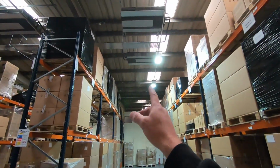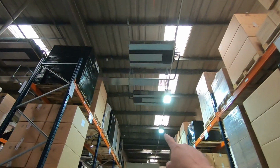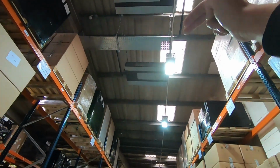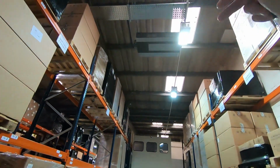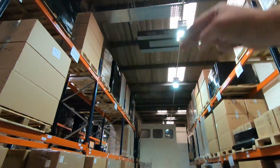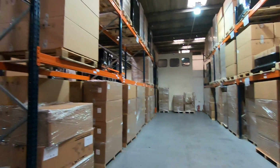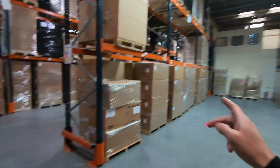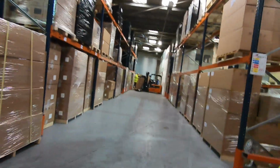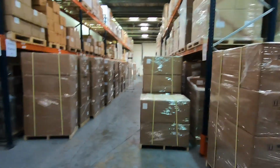I'm going to laser a straight line, and I'm going to jack chain from the purlins at equal distances. I'm going to jack chain them down no lower than the air conditioning or the trunking, so it's not going to be the lowest point, it'll be just above, and then level them off because the roof's at different levels. Then that should give a nice light down here. So I've got 3 rows to do. This one's got 3 lights, the second row's got 6, and the 3rd row has got 6 as well.